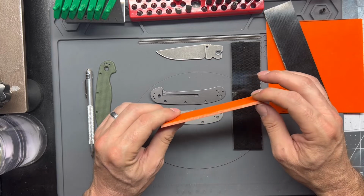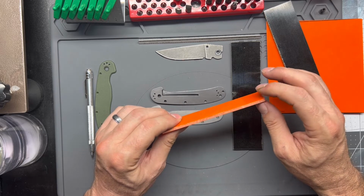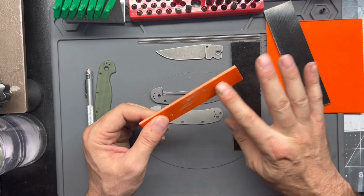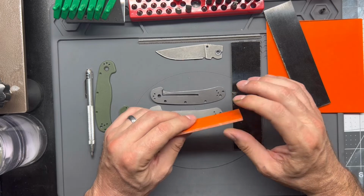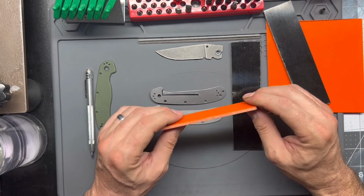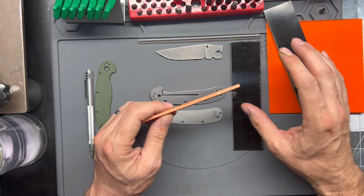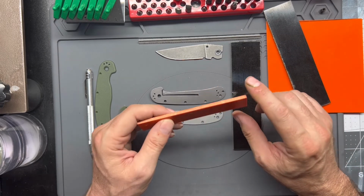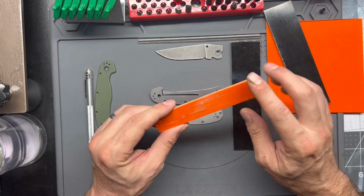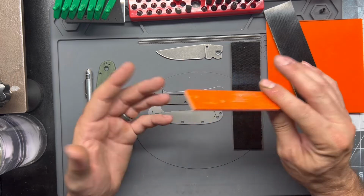But yeah, this is slightly thicker than what we need it to be, so I'll have to take it down a little bit on the back spacers, because it's a critical clearance area. I find it best to start out with a much bigger piece than you need, and then grind back to the shape. It just inevitably ends up that we're gonna have to thickness sand this, and I don't have a fancy thickness sanding machine.